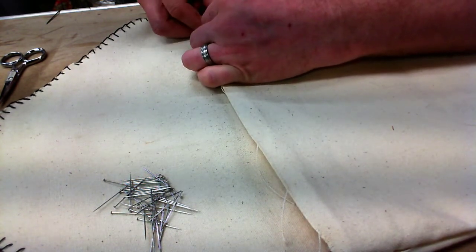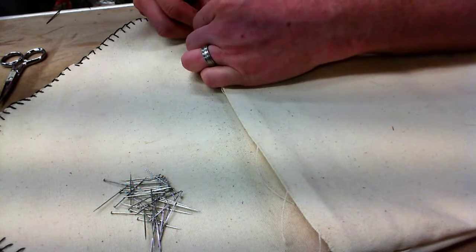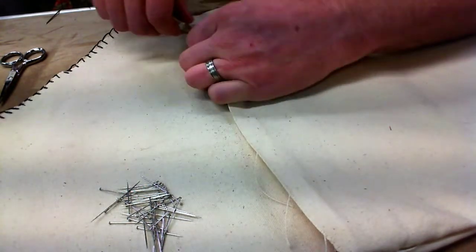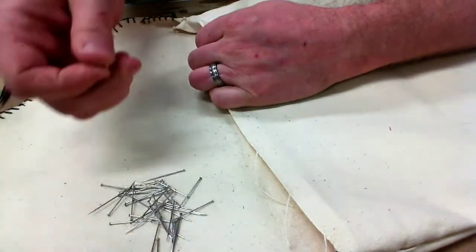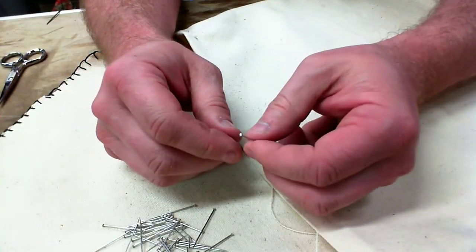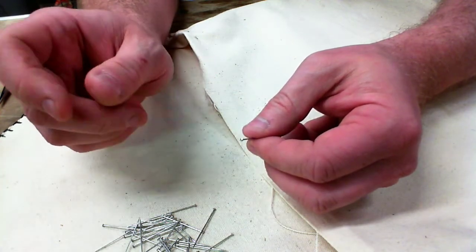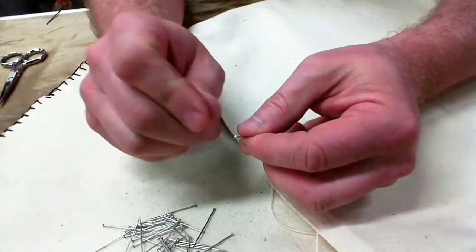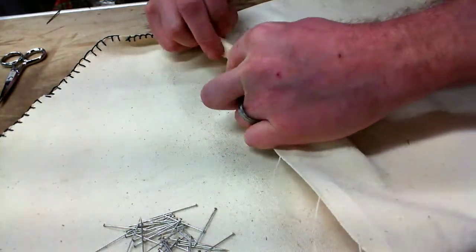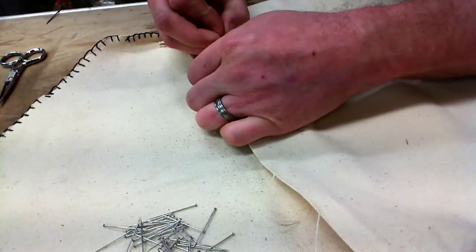Because you can make them at home, and they'd be made of brass, and you'd buy wire, and then, oh, that's hard to pin through. You would put a head on it, either by twisting or by heating it up a little bit, or heating up another rod of bronze and putting a little dollop of metal on the end. And then you would sharpen it on a stone.